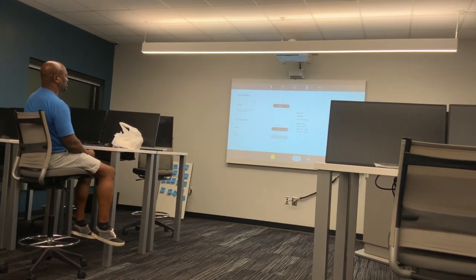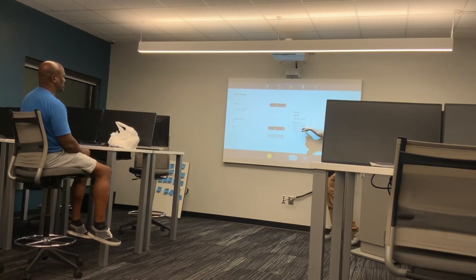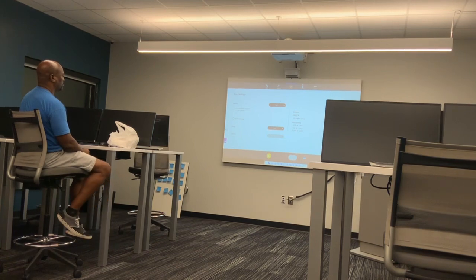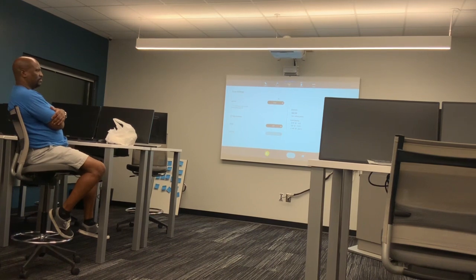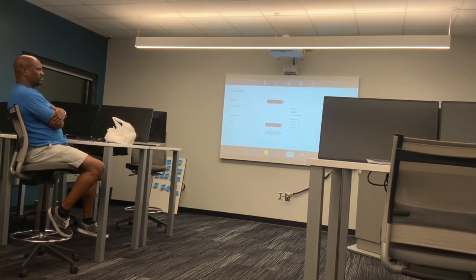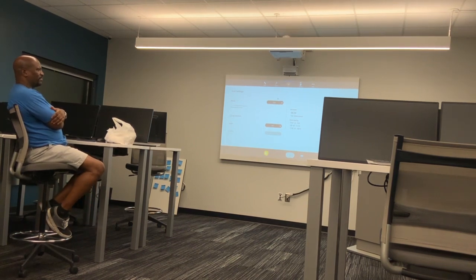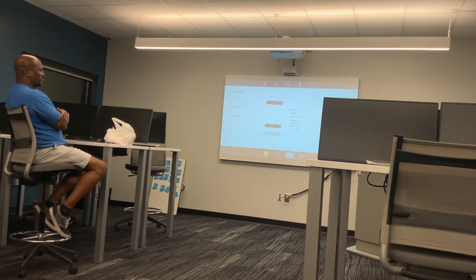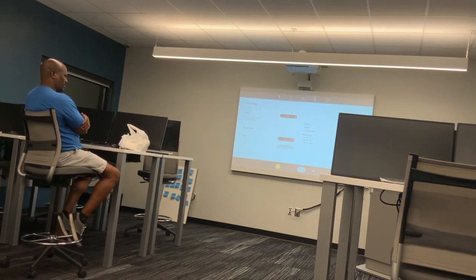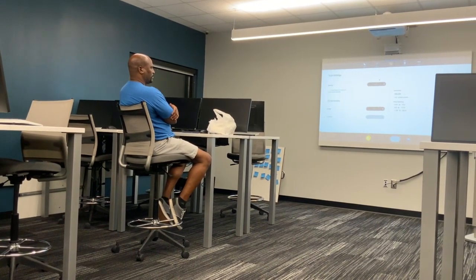As you increase the scan level, file size increases too. On high level, that's a little over six and a half minutes and about 125 million points per scan on average. These tablets are Windows Desktop Pro, but this one only has a 256GB hard drive. If I do a bunch of high-level scans I'll eat up the memory, so I work in low to mid range and use high density only when I need it — like scanning a mechanical room with small conduit or wiring.